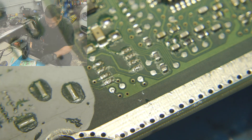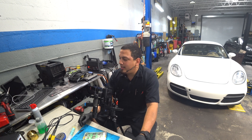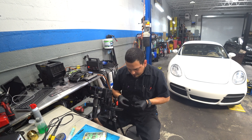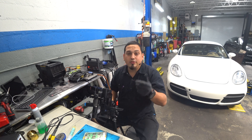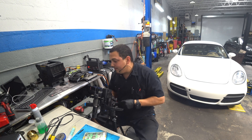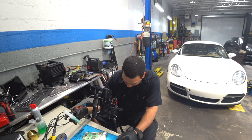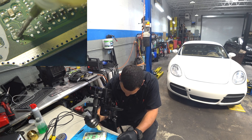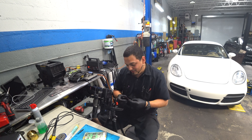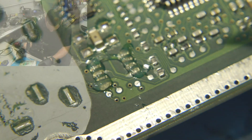Let's say you've grabbed your EEPROM, put it on your programmer to grab your data, or you're ready to install. I personally don't like to use hot air to install — I like to clean up the pads first. I use a solder wick. For this part you're going to want to use flux. You never want to use a soldering iron without flux in place — that's one of the key things if you're going to be practicing.